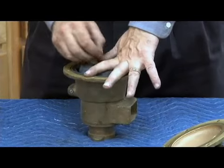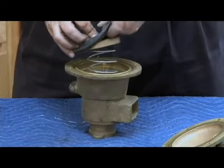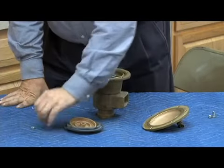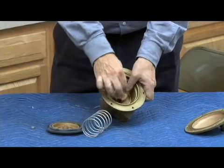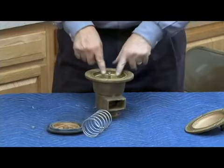Once I have it loose, one nut comes off, the belt, that rolling diaphragm washer, rolling diaphragm, diaphragm support. There was spring tension underneath that little nut when I finally removed it, as you saw. Relief valve spring comes out next. What happens next I see is my relief valve stem. Just like with the 3/4 through 2, we've got to turn it upside down to get the seat out.